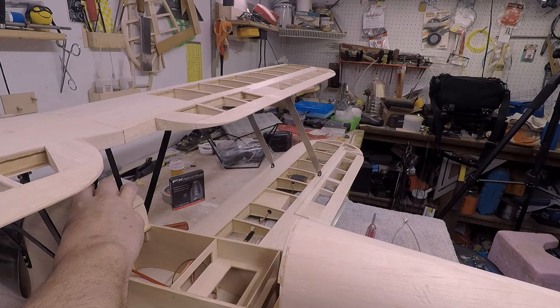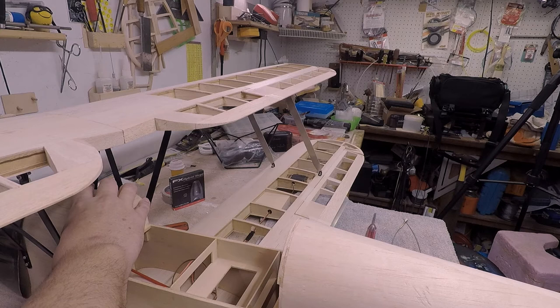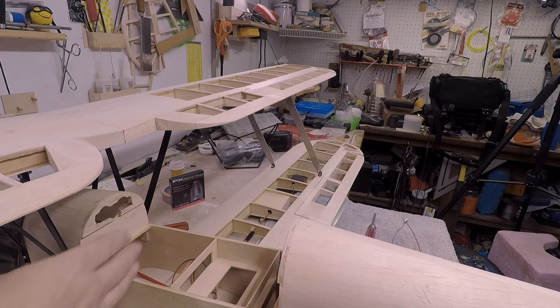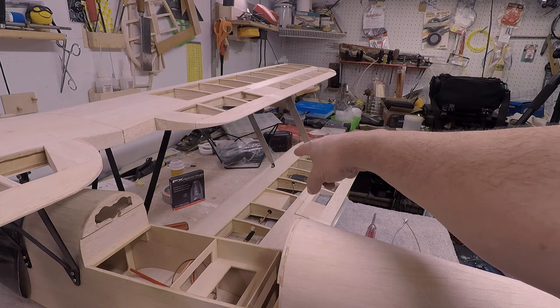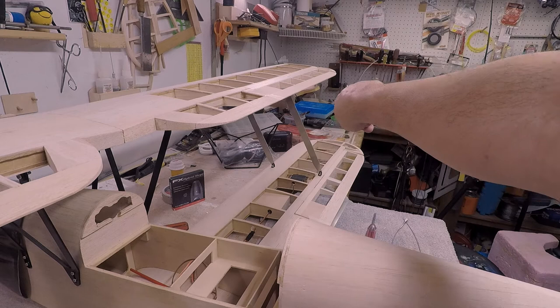The side to side — since that's gone, I don't really need to put the cables in there. Now with the rotation, there's a very little bit of side to side rotation. It's not as tight as it can be. When I put the interplane struts on, those will be tightened down properly. Right now I've got the screws in backwards — I've got to spin them around and have them face out. And then there's going to be three millimeter lock nuts on the backside of that, so that'll really tighten everything together.